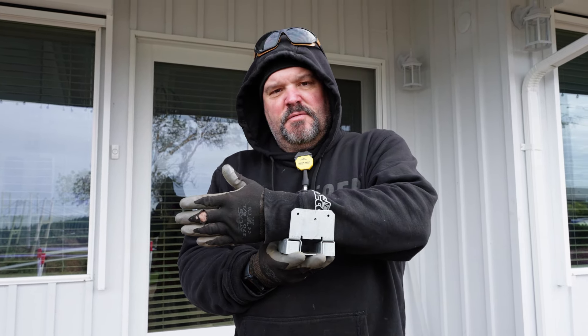We're going to use a half-inch bit on a rotary hammer, which we have right here. I've identified the crosshair where I need to drill the hole. We're going to run a vacuum to collect the dust — dust extraction has become a really hot topic. We don't have a HEPA filter for this particular tool, so we're just going to run a shop vac to keep the dust down to a minimum while we're drilling.